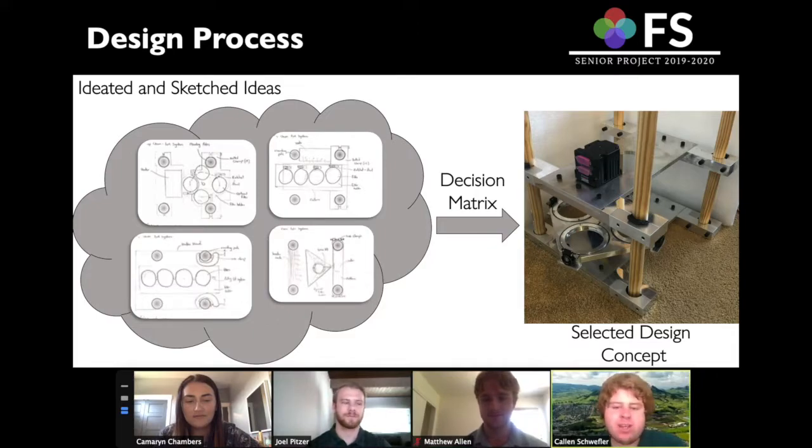When coming up with a design process to fulfill these needs, we ideated and sketched out our ideas, coming up with several different iterations. Then we ran these ideas through a decision matrix to come to our selected design concept. This was our ultimate design that fulfilled a couple of requirements: making sure it could fit in a given space, which was an issue for some of the previous iterations, making sure it was made of aluminum, a requirement from our sponsor, using screws instead of bolts, and also using a smart motor. That all came together to come up with the design we ended up using.